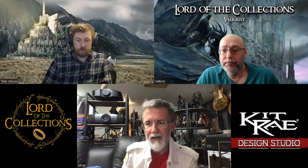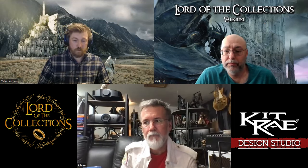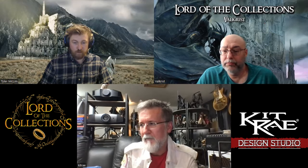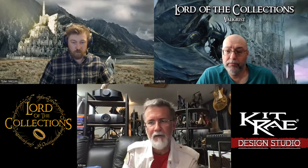And this is before we do any plating or anything. We'll look at any fit issues where things don't go together quite right, and you tweak the tooling a little bit. So we're like 6 to 7 months down the line now from starting, and then you'll start testing different plating finishes to get the final finish on the surface of the parts, and go through another round of prototype stages. Back then we were probably 4 to 5 prototypes, depending on the complexity, before you've signed off on one.